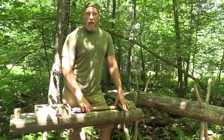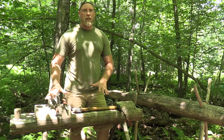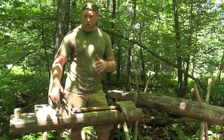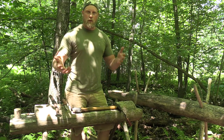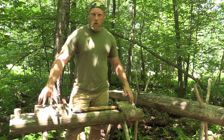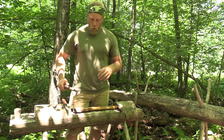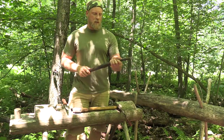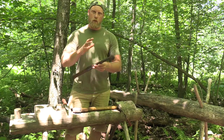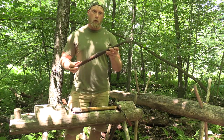There are a couple of different tools I wanted to talk about today to get the job done appropriately. These tools are all pretty much interchangeable, but using the right one is going to make your life a lot easier. For larger lumber — anywhere from eight to twelve inches or larger — the tool of choice is going to be a barking spud. These are specifically made to debark timber, and I'm going to show you these in action shortly.